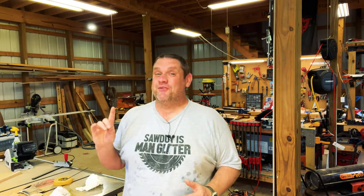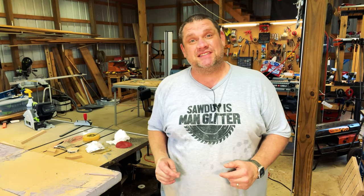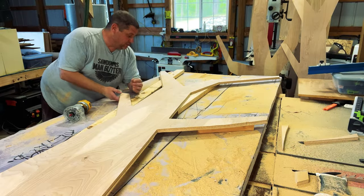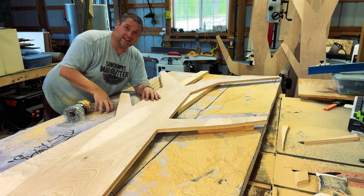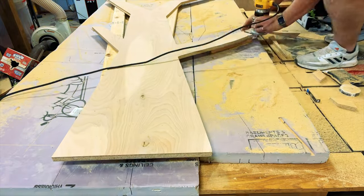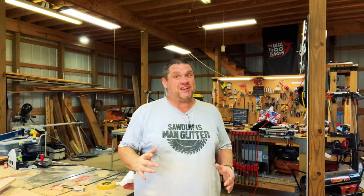And with that dusty job, we have our first tree done. I can remove the Shaper Tape and put that tree to the side. Now with that first tree done, let's take a closer look at what's left on the second tree. You can see there's just a little lip that we have to remove. We can rest our bearing on the cut we just made to remove the rest of the waste material. I'm going to place a couple of 2x4s underneath the tree to raise it up a little bit, making sure the router won't eat into the styrofoam. That'll do it for that second tree — let's go stack that tree up next to the others and see how it looks.